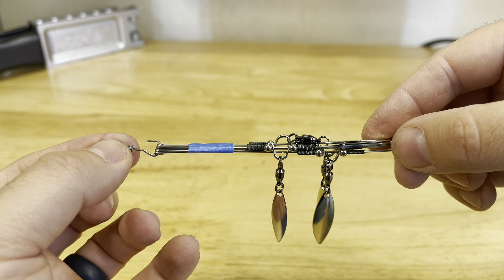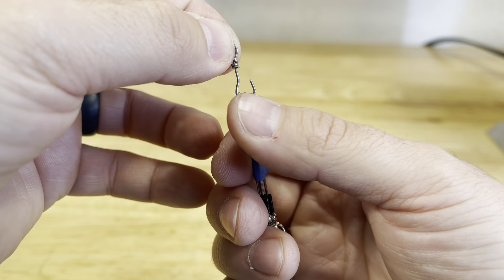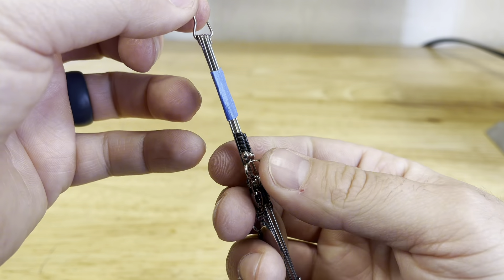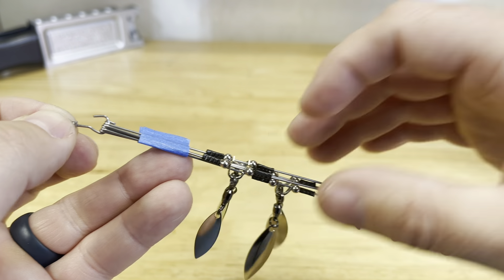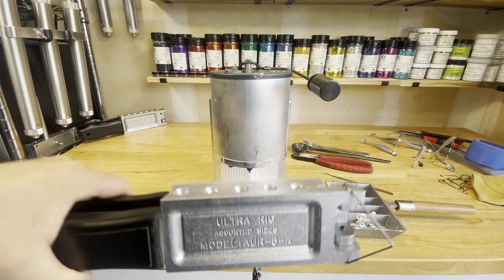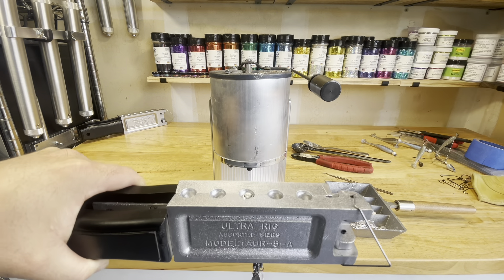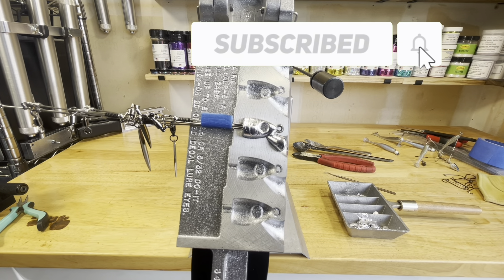This is what your final wire form is going to look like. You can see why we widened out the bottom of that — if you don't have it widened out just a little bit, it'll kind of crunch up your wires and deform them. So now we are ready to lay this in our mold and get to pouring. Make sure your mold is closed all the way. Since you do have all of that hanging out of the bottom, it's not going to fit under there, so I just set my lead pot to the edge of my workbench and pour it just like normal. And there you have it — there's your poured lead. We're going to clip off our sprue, clean it up, and get it ready for powder coat.